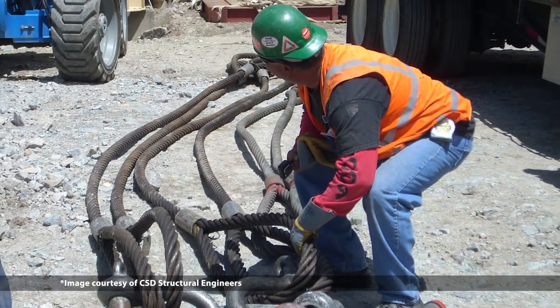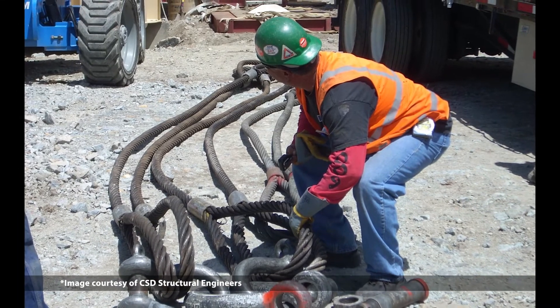What's critical is you get out in the field and talk to these folks. I'll go out on a project and have an ironworker say this connection was really challenging — why? It was tough, guys tied off and hanging, really difficult to reach in and get to it. So I asked: what would you do differently? And they said, if you could pull this connection out just six inches, the guys can access it easily, use normal tools, and it's not awkward. It becomes more comfortable, more efficient, and it's safer. That feedback is so important.